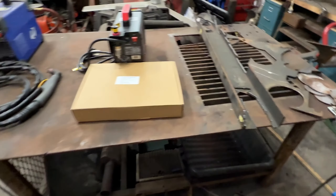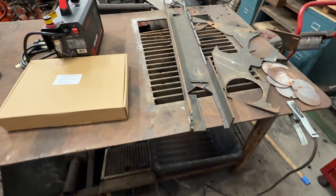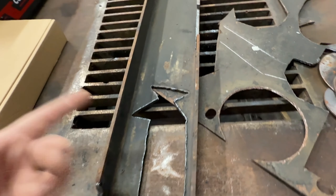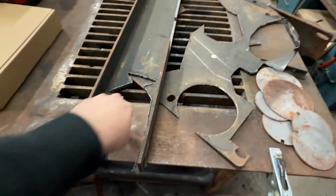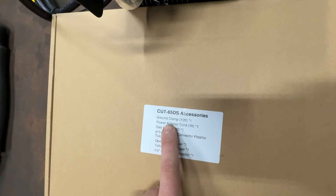This is my cheapo cutting table - I got it very cheap from a guy who was going to scrap it. I've been cutting some quarter inch thick with the Cut 50, and for a cheap little machine that's pretty good. If you go slower you can get a very nice clean cut, but some people rush and then they wonder why their cut is all curved.